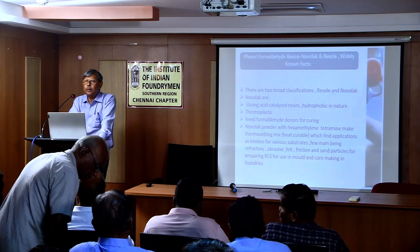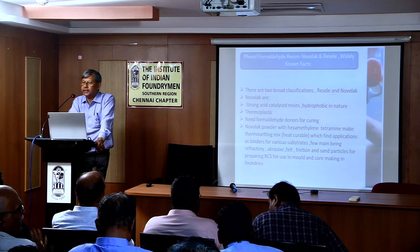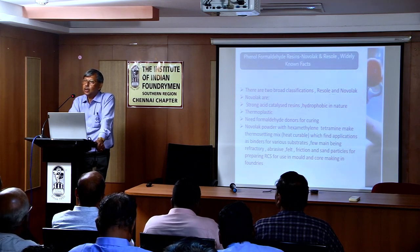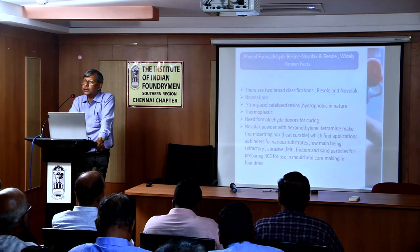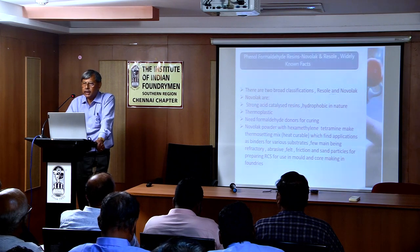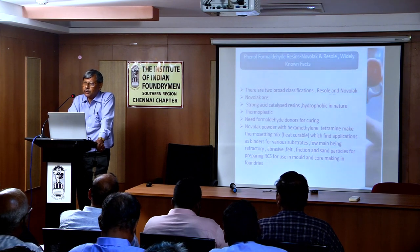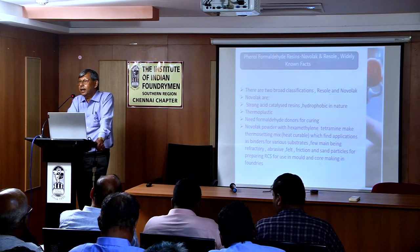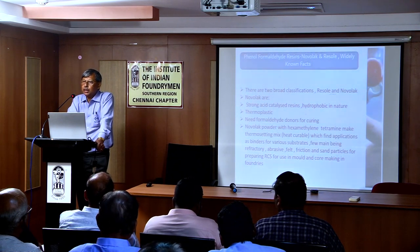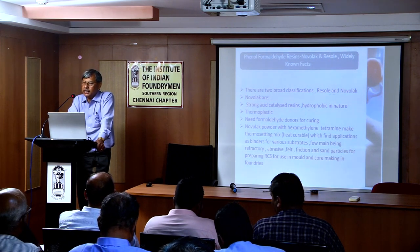Definition: if you go by the chemistry of phenol formaldehyde resins, you will see on the first page itself that there are two types of phenolic resins, Novolac and Resol. Novolacs are those types of resins which are produced under strongly acidic conditions. I am going a little to the technical side because in the last 4 decades after introduction, so many papers have been read, and mostly these are on the application side: what is the amine temperature, amine pressure, all these things. But chemistry-wise, many are interested to know what exactly the resin is, the hardener is, and the catalyst is.